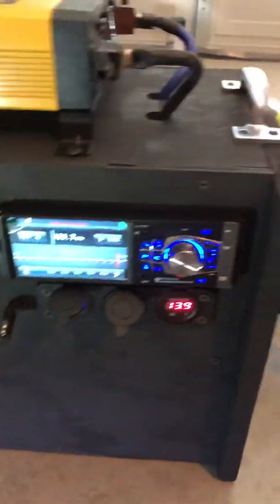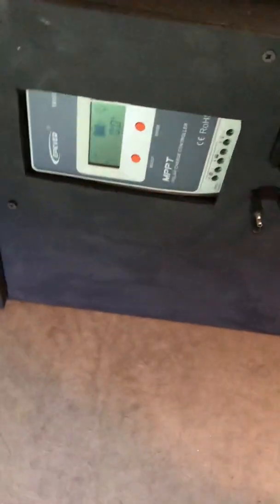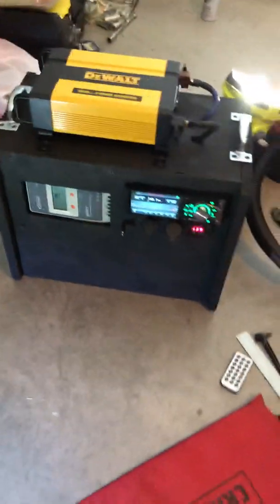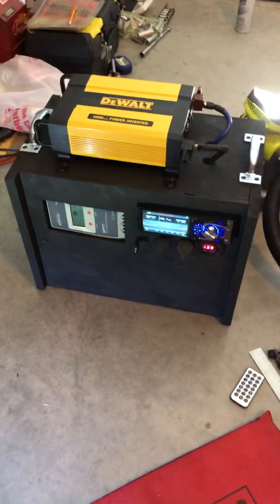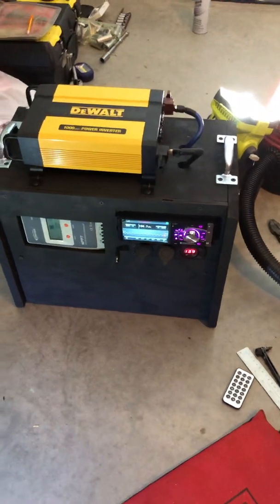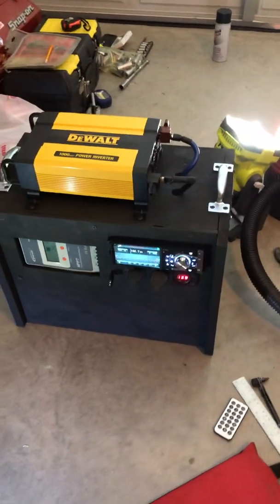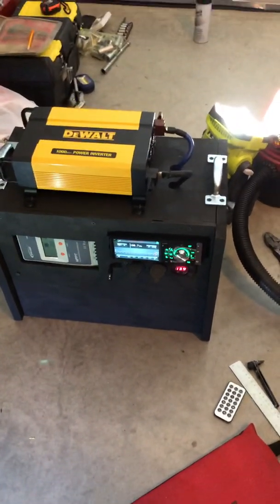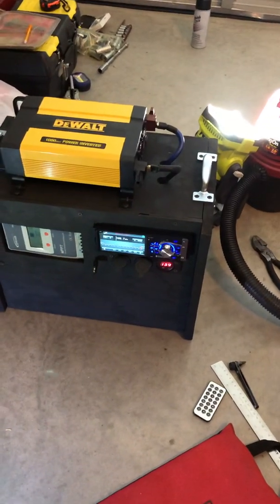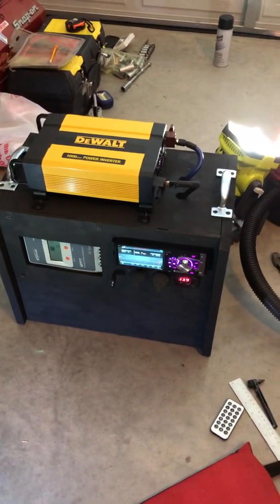Small feet, but feet nonetheless, and it's not painted down there yet — I just finished this. So there is my portable power center, all wired up and ready to go. If the batteries were fully charged, this system would have a sitting voltage of about 16 volts on the high end and 10 volts on the low end. The BMS will not allow it to go that high or that low though — the low-end cutoff of the BMS is 10.5 volts.